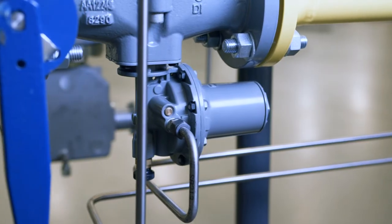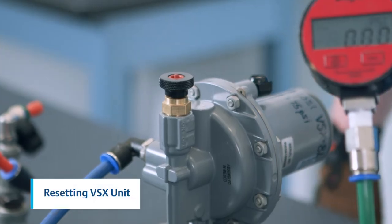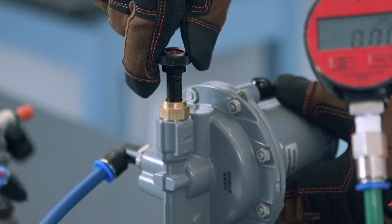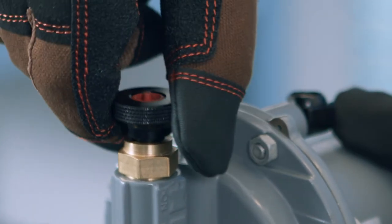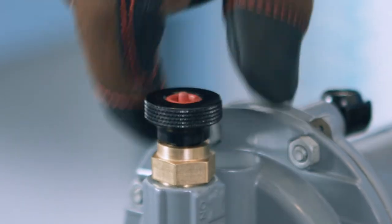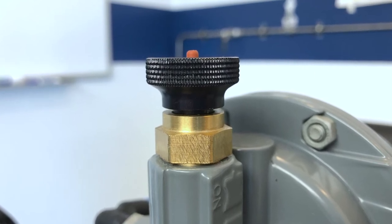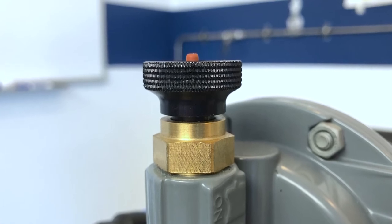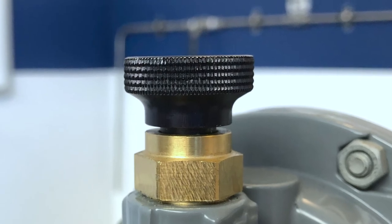Check the system to ensure the cause of overpressure before moving to reset the unit. To reset the unit, slowly pull the black handle back until the plug has engaged the cam. You should hear flow if downstream demand is present. Pull back until the handle stops — you should hear a click as the cam resets. It should be about one inch. Slide the reset plug back into the actuator. The orange indicator should now be visible one-eighth of an inch exposed. The VSX uses an orange indicator on the stem to indicate if the unit is tripped. If the indicator is no longer visible from the side, the unit has tripped.